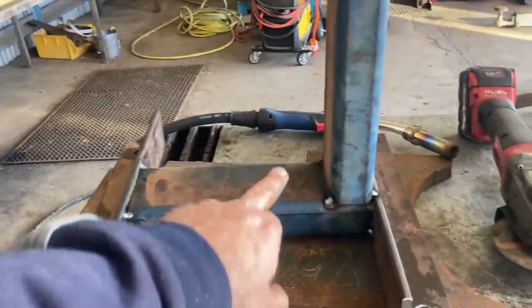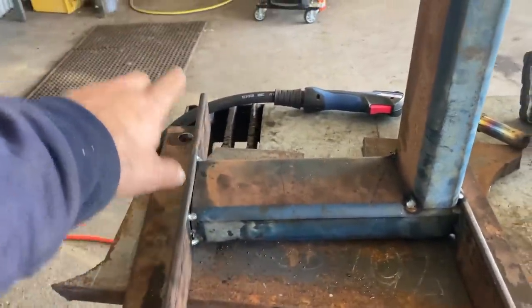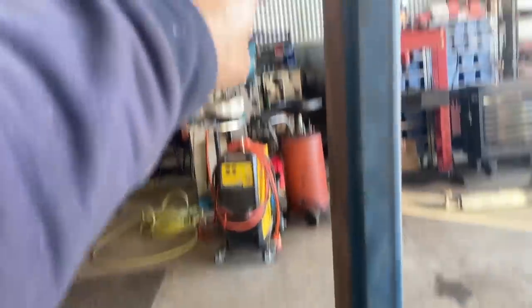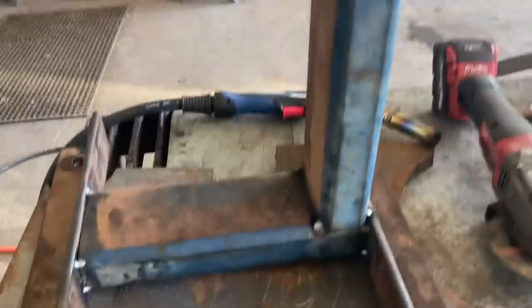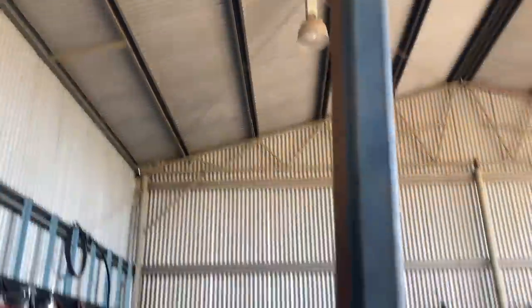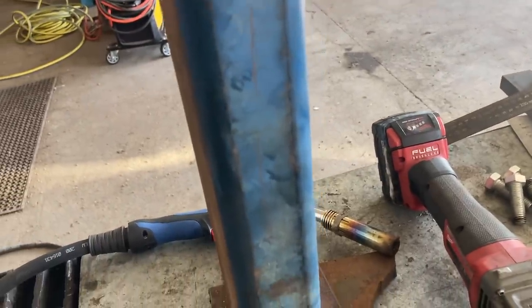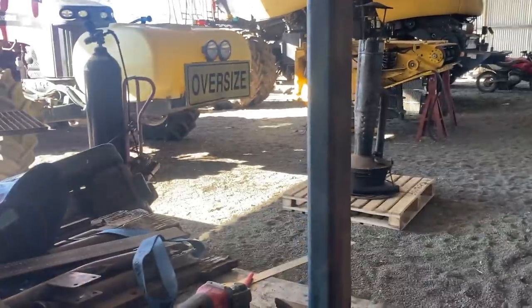What we're going to have to do is brace that down to there, because where this bolts, you've got the fuel tank comes up here and goes up like that. I need to then up the top here, weld another bit along the top and brace that, because the lifting point will be out here. This steel here is pretty sure that's six mil thick, so she's pretty sturdy stuff. We'll just keep plodding along finding bits of scrap steel that I can use.